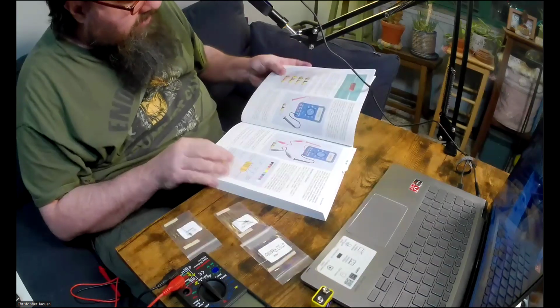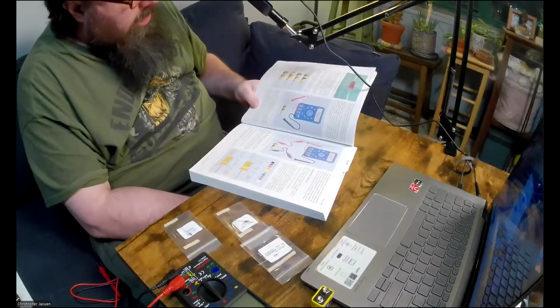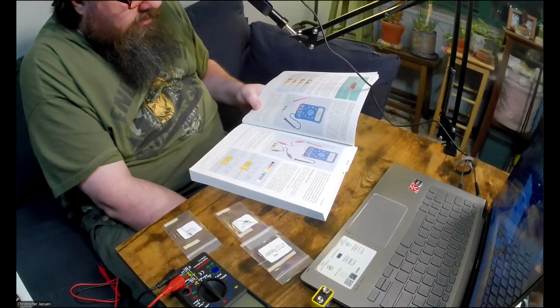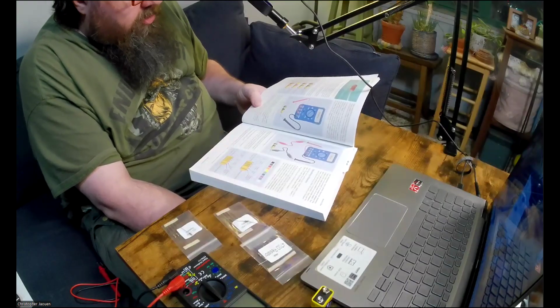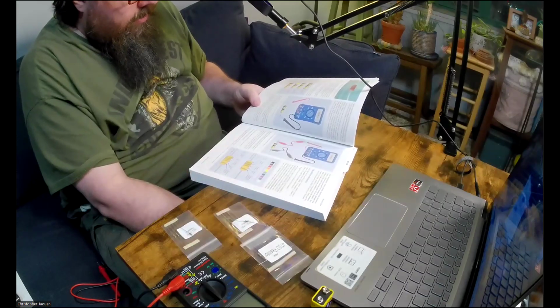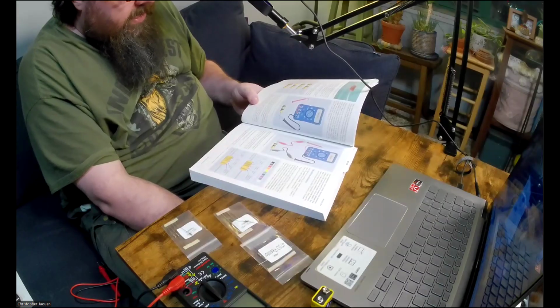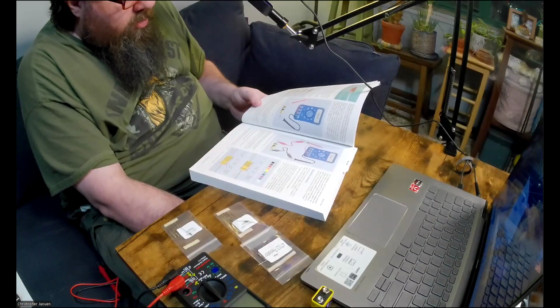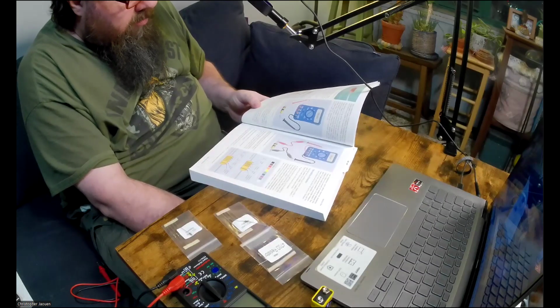overload message, or I guess that means open lead or overload. I'm not sure. OL. You'll get an OL error message until you change the resistance on your meter dial from 200 ohms to 2K. Finish by checking the 1.5K resistor. I'm betting the values which you measure will not be exactly what you expect. The values I found when I tried this were 15.1 ohms, 148 ohms, 467 ohms, and 1520 ohms.